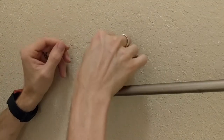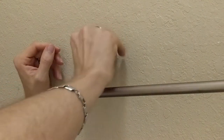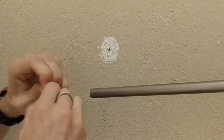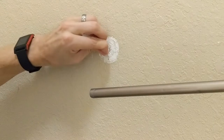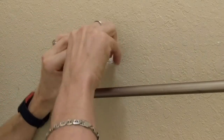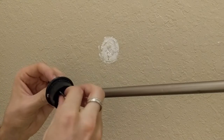Now we're going to push this right into the hole as best we can. It might need to be a little bit shorter — maybe about a half inch. Tear this in half so you don't need all of it. Stick this in there and use that little drill bit to help push it in. There we go. So now we have something more for our screw to latch on to.